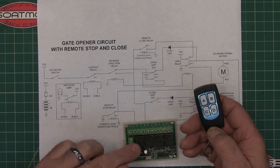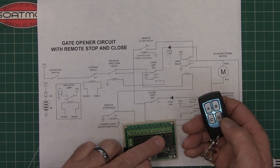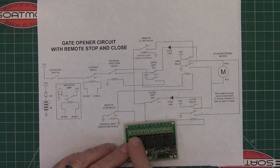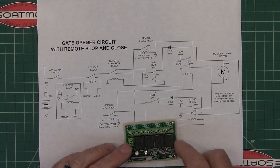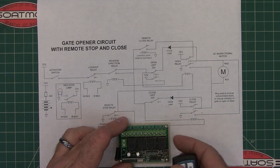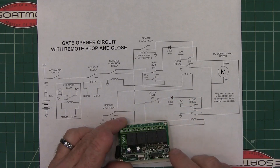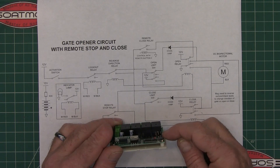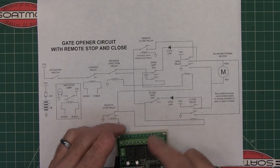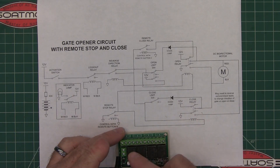When you hit button A on your key fob, you're activating the first relay; B activates this one; C this one; and D this one. You have to set these up so that the relays close momentarily and open right back up. I took the jumper off, which means it'll just trigger intermittently. There's an instruction sheet that comes with it — the instructions aren't great, but that's how it works.